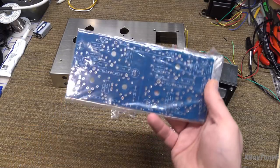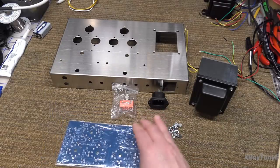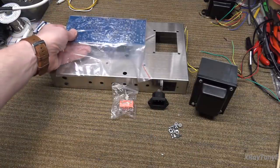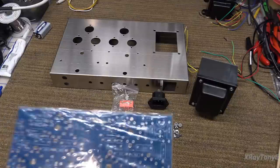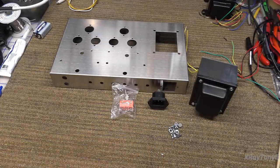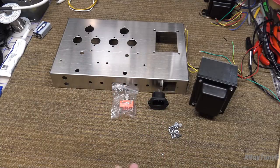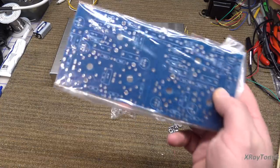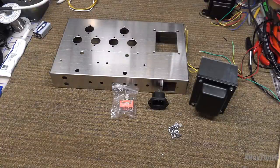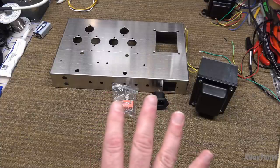I'm not a big fan of vacuum tubes with printed circuit boards. Although this one's a pretty good design, once you get the boards and sockets mounted up it can be very difficult to replace components or test anything. I want to build this in the very traditional point-to-point construction method — no circuit board. If we have to substitute some components to make it fit better, I'm going to do that.